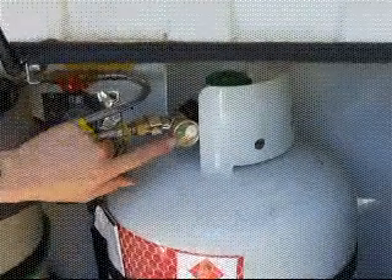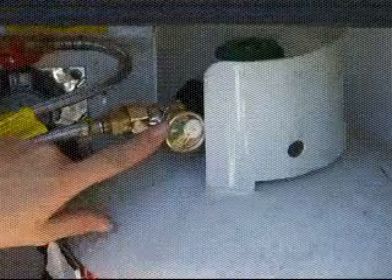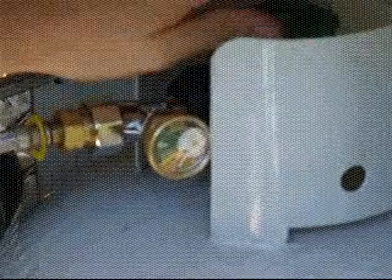There's a gas fuse here which you need to know how it works. You can see that's on empty. If we open this anti-clockwise, the gas bottle will then open. We need to pump this button by depressing the gauge a few times, and then you can see that you've got full gas and you're in the green section.